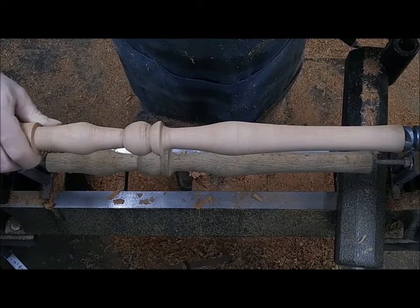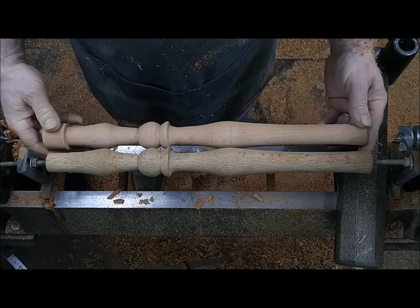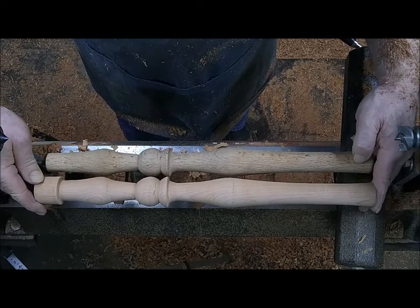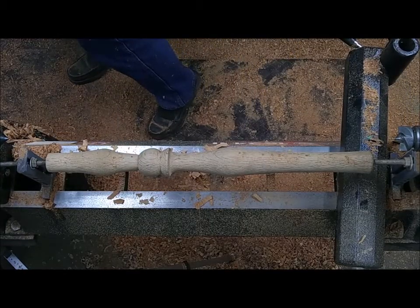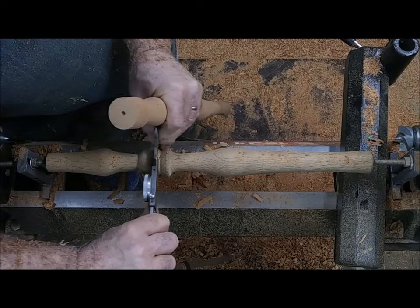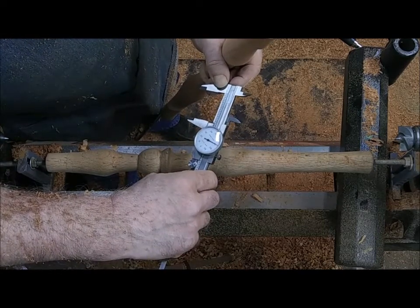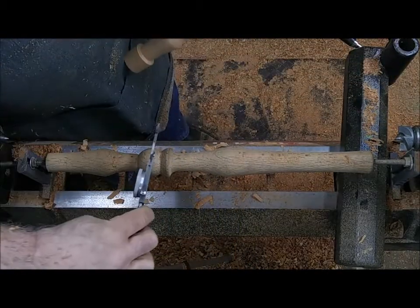My Lathe Tool Freestyle section — you can also freestyle it. Let me show you what this looks like down low against the master. You measure that out and you're going to get — I mean, it's not super tight tolerance there, but let me just show you. Let me measure this ball, because that's a pretty good standard. This little ball turning part here — I got 1.672 inches. 1.672 right there. And that's at my high point. So if I do that over here, let's see what we're getting.